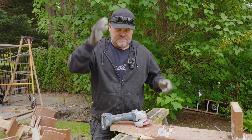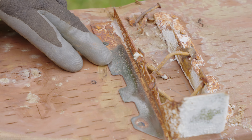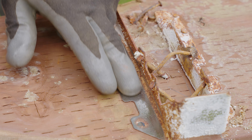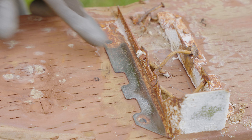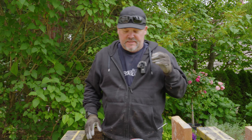Let's sand out this second hanger — I anticipate a similar look, but this one does seem to have a little more rust on it. This one's pitted worse, and there's your proof right there. You can see it's really getting in, and even through my glove I can feel the imperfections in that joist hanger. Something to definitely consider when you're building in extreme environments or a saltwater environment: use a premium product for your metal connections, or else they're going to fade away. I've been on a bid for a person whose house was built on piles over saltwater, and anything that wasn't stainless steel was rusting, corroding, and failing.